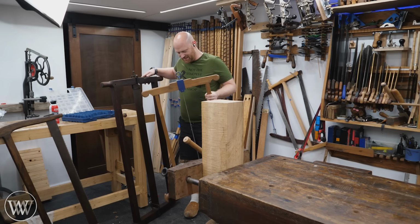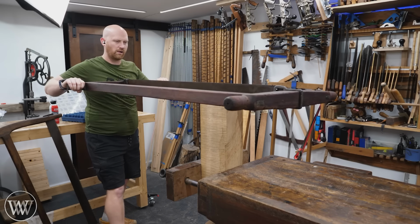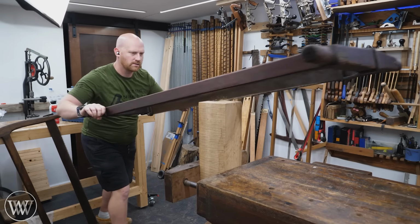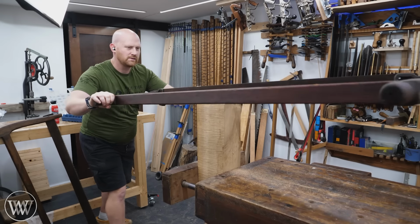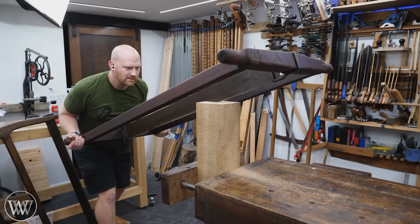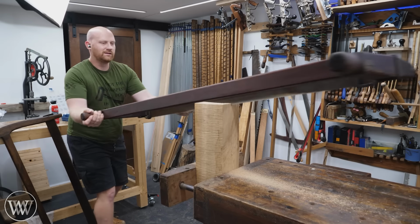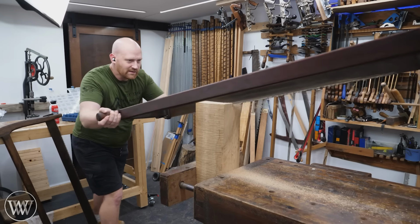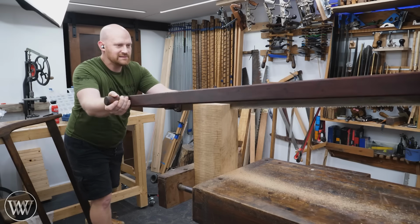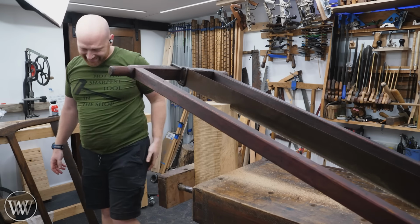So here's my large frame saw that I made in the past. And everyone says, well, that's a huge saw, but now in comparison, it's not. This thing is so large, I can't get a full stroke on it. Now, normally I would lean the board away from me, but in this case, I was just in a quick hurry, so I put it in the vise because I needed to get the video out. So it's vertical, and so it's going to be bouncing a lot more. Also, the teeth need a little bit more work. I didn't do the final detail on this one, and I think I need to add a little bit more set into it. So this is the first little test, but I was actually really happy it started marching through this. This is a large block of white oak, and I'm going to be using this in the future. Once I do a little bit more cleanup on those, we'll have some fun.